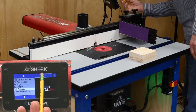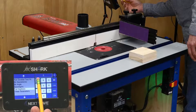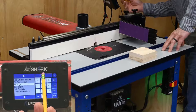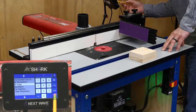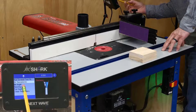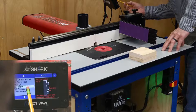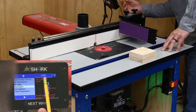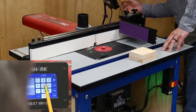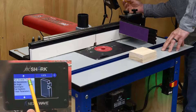Start at the bottom with the tail depth. For this project, I'm setting this to 3 quarters of an inch, which is the same as the thickness of my board. Next, enter the bit angle, which is 7 degrees in this case, and then verify the bit diameter. With the bit information entered, open the spacing setting. Notice how it recommends a setting of 0.878 — this is a good place to start for the first test. If this proves too tight or loose, I can fine-tune it by adjusting the spacing up or down a small amount. The test dovetail app is now set up and ready to run.